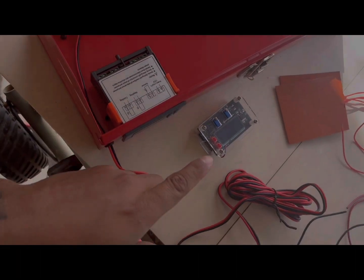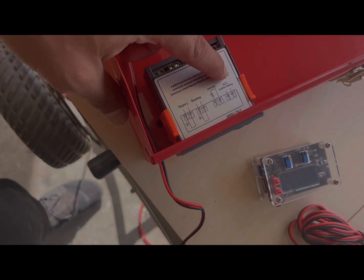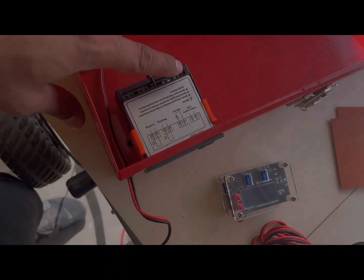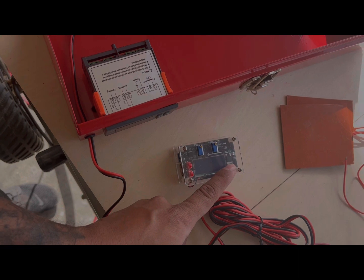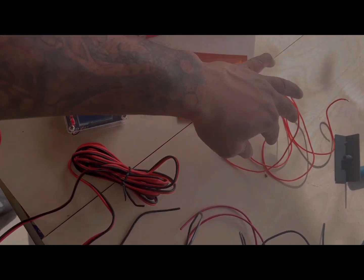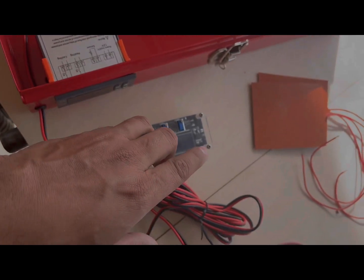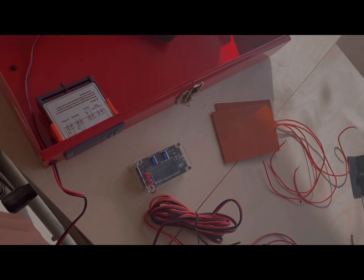The next thing is the buck converter — we need to do the wiring now. The controller gets 12-volt power supply to pins 1 and 2. The sensor goes to pins 3 and 4. We'll need a little spare wire because we're going to bring 12 volts into the power supply and also jumper it to the input of the buck converter. The output of the buck converter — the 0-volt side — goes to one leg on each heating pad. The other legs go to the switch for heating, and the positive output from the buck converter goes to the common on the heating side, which is pin 5. We do this to adjust the current output, so only a certain amount of current flows to the heating pads.